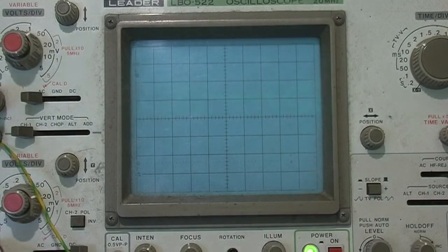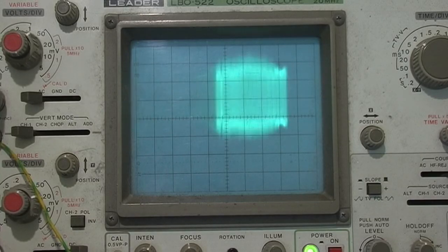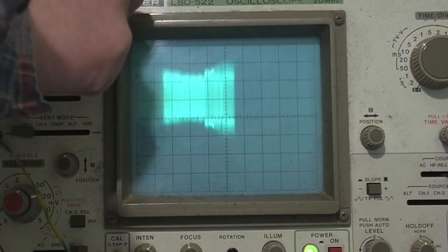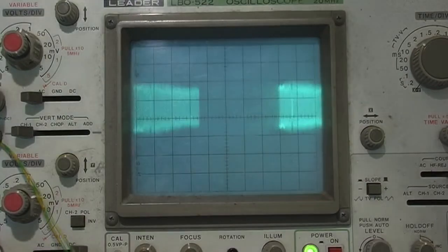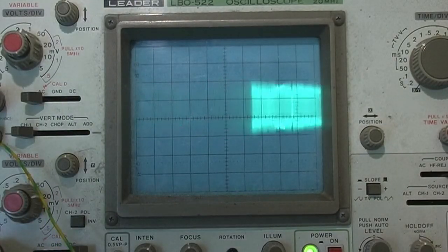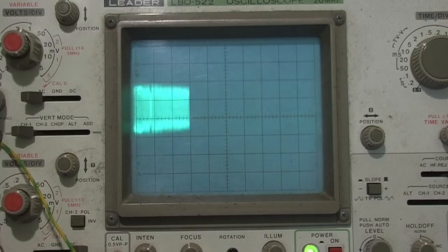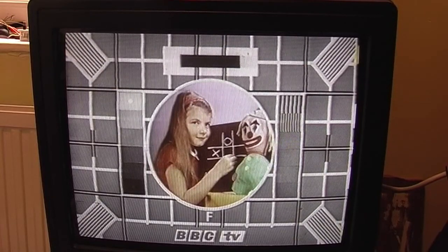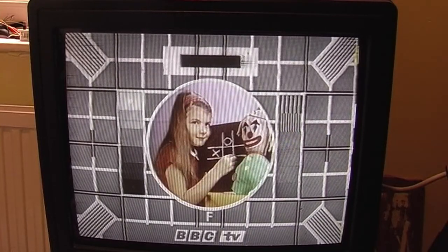I'll try adjusting the FM level, see what happens. Say it's 300 millivolts there. It's not causing black streaking inversion on the screen. Well, I'm not on that test card bit of tape, so I'll wind it back to that. So this is it at that level. Turn it up to 300 millivolts like I did with the other one. Gets a lot worse. And there's actually no point at which it doesn't have that inversion going back and forth